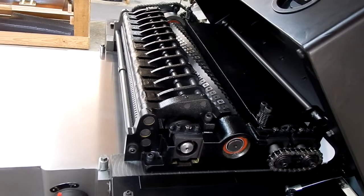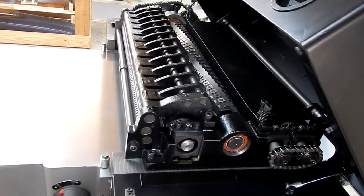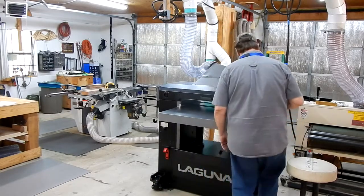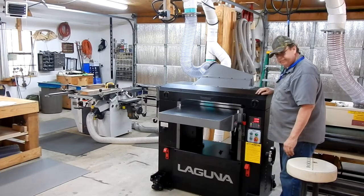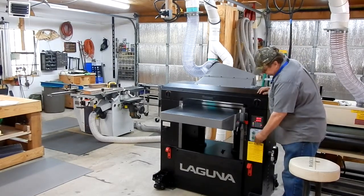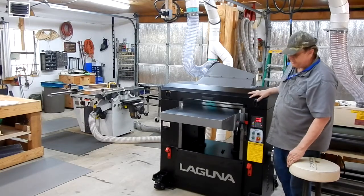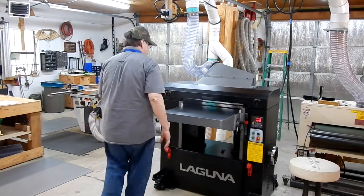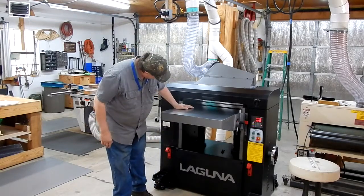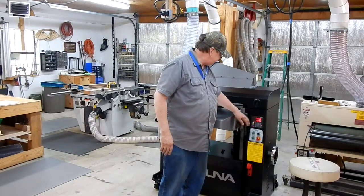You're able to see the Sheertech II head, and this one's got double rollers on the back side — it's a nice planer. The fit and finish on it is nice; the tables are real nice, smooth with no defects. Same way with the wheels. You've got the in-feed and out-feed wheels in here that adjust on the side. You can raise them up to five thousandths of an inch if you need to for rough lumber.